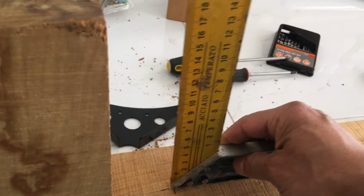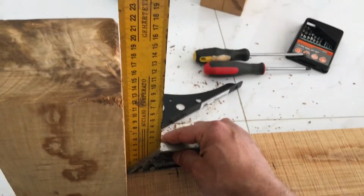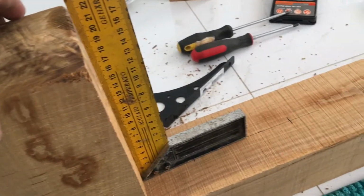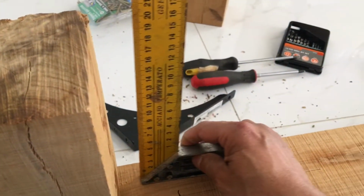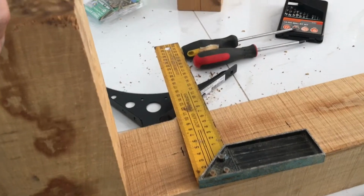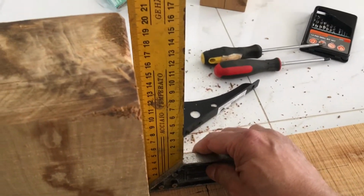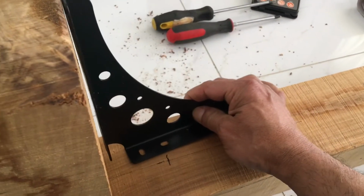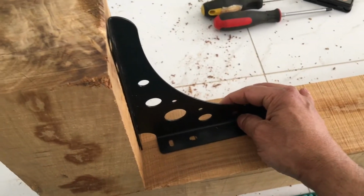it's important you turn your job around until you get the perfect right angle. So one of the angles will be definitely right, so you have to turn your job around. So this one is right angle for me, right? So if I turn it around and use it like this, I'm sure it is not going to be a right angle. So make sure you use one of the angles which is perfectly right. Okay, this is important. The rest of the adjustments you can do lighter, but this is simply because you need to make sure that this angle or the beautiful stiffener sits square, right? That's the goal.